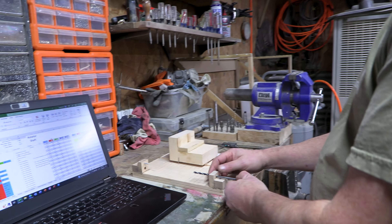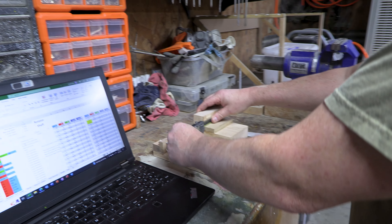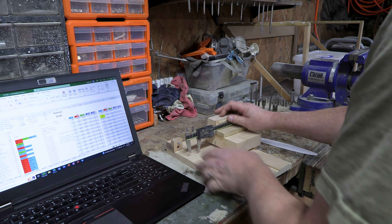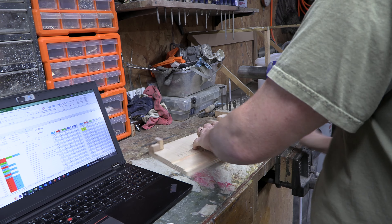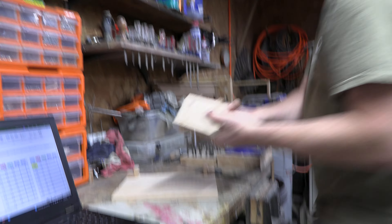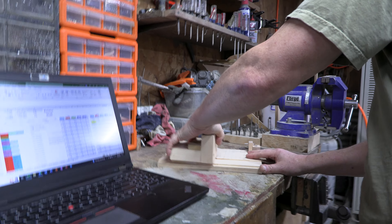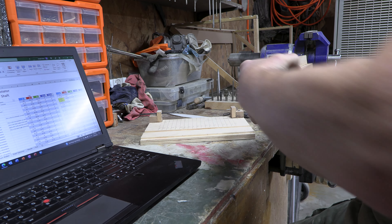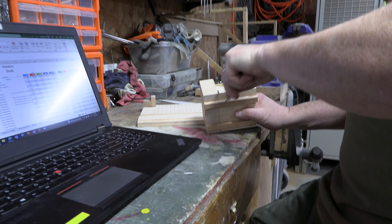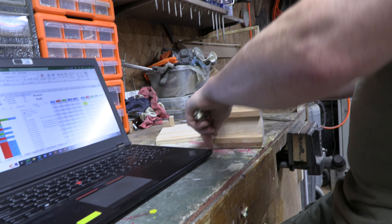Normally what I do is I make a plug, drill the lip, drill the back tail, and just use this to hold the plug. I turn this on and measure the diameter at every half inch or quarter inch interval. The wood will expand and contract with moisture - it's warm and wet out so it's not sliding perfectly as I wanted it to, but we'll be able to rectify that. We'll also put wax on it so it'll slide better.